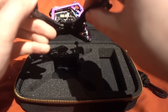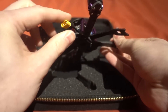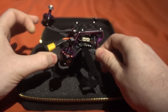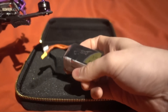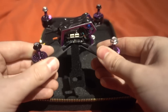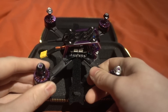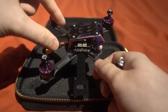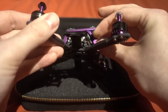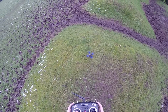It's probably best to switch to GemFan propellers as they're much more modern and have more pitch. We've also got a battery strap included but I'll need to install it — there looks to be plenty of space underneath. We have an XT30 connector at the back, which should be standard these days. I'm going to be using Tattu 850mAh batteries. There's also a flat top plate in line with the camera, so you could mount a Mobius mini up there no problem.